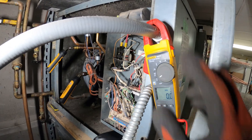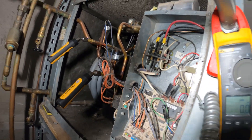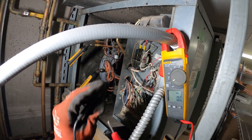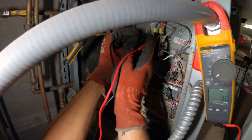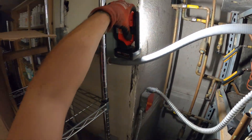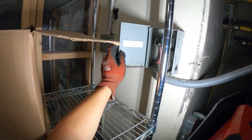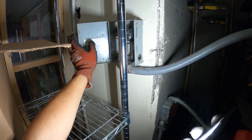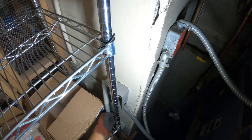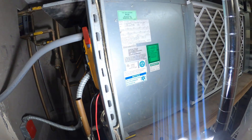Let's make sure we have incoming power — power is coming in here, goes right into the contactor. Okay, coming from this pull switch — the breaker popped on this one. Let's make sure we've got power coming in here too, and let's make sure it's not on the same breaker as well.